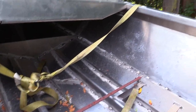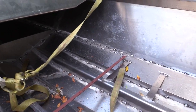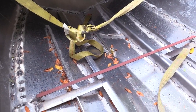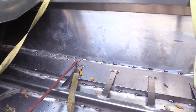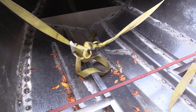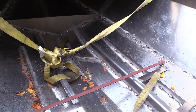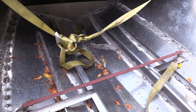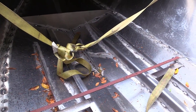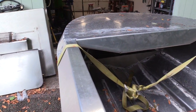'Cause right now it doesn't matter if I break those engine bearer welds and try and reassemble the front end. One side's higher than the other. Thought, well, maybe I could take out that brace, cut the engine bearer welds on the outer side, it would loosen up the hull. But even then, my starting point is that keel. So whatever I do, when I pull that pressure off, I don't know which way things are going to twist. It might just go the same direction they're going now. Maybe all these things are holding it from going even further. To where if I pulled that stuff off, maybe I'll have 1.5 inches or 2 inches on this side.